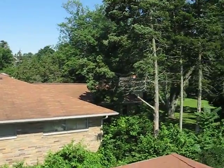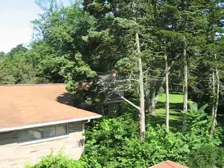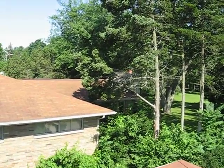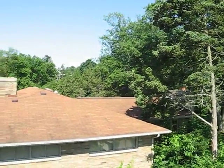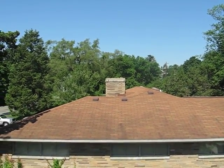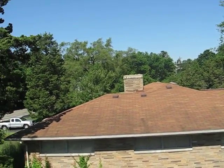I actually redid the chimney over here on this house too, back here behind the trees. Did that probably about 5 or 6 years ago. Guy had a lot of leaking problems. We tore it down below the roof into the house, re-roofed and re-flashed it, poured 4 inches of concrete on the top, slab type crown wash, and then redid just the top of that chimney. Ran a couple courses of limestone and the 3-inch poured concrete crown wash on the top.